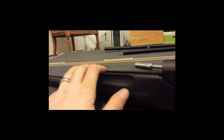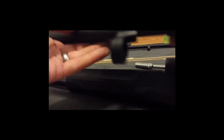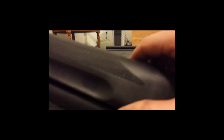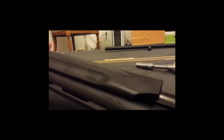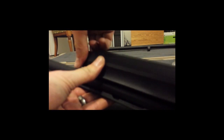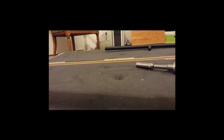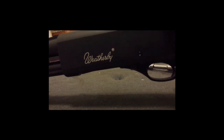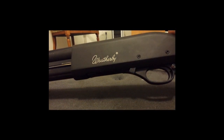We're going to need to put the barrel on as well, which is right here. This part takes some finesse, but essentially you have to get this ring over the end here as well as slide the housing into the chamber all at the same time, which is not necessarily difficult. And then you just screw the cap over the top. Oh, and that's it. Just make sure it's working. You can see the slide release still functions the way it should, so we'll go ahead and dry fire it. Slide release recesses, and we can cock it, and it comes back into place. Can't slide it anymore. That's it. That's all there is to it.